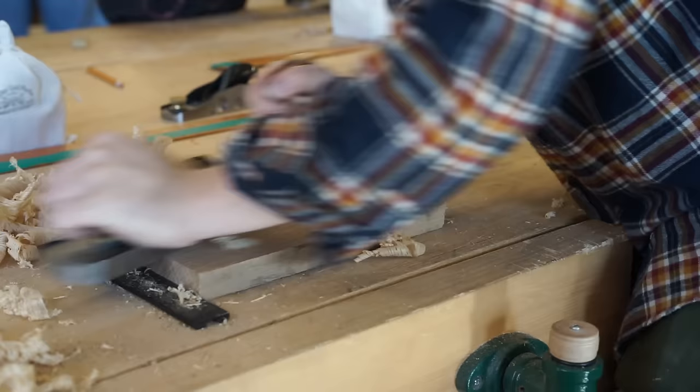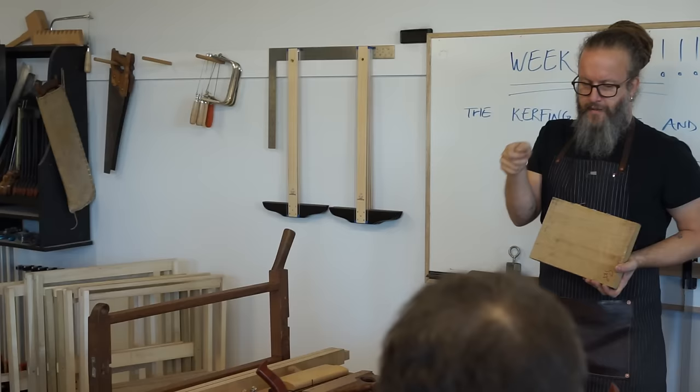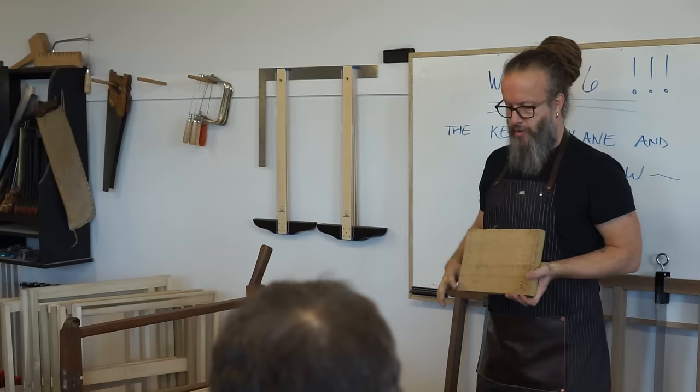Square the bottom edge for reference, then use a combination square and your saw plate from the kits to accurately mark the saw nut hole positions. And that's really critical. If you miss it by a whisker, we can file the saw plate and open up the saw nut holes. It'll still be trapped between the two screws. It won't move around.